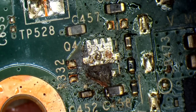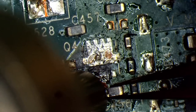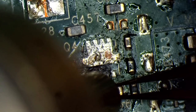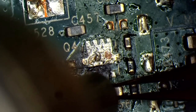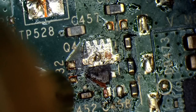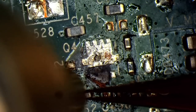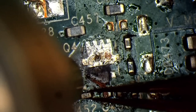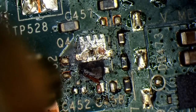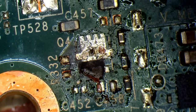I think that top layer needs to come off. I've got my hot air set at 480 degrees Celsius, 20% airflow. It's heat-seized on there. I'm going to remove the cap that's next to it as well. These are pretty much heat-sealed on. What I've done is removed those components because there's a good likelihood that they're shorted, so rather than wasting time just remove them anyway.